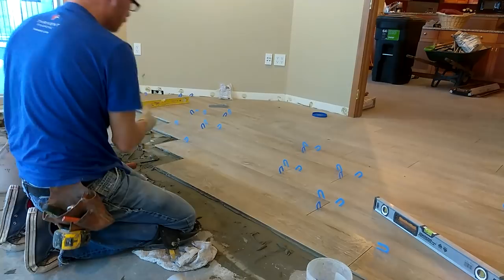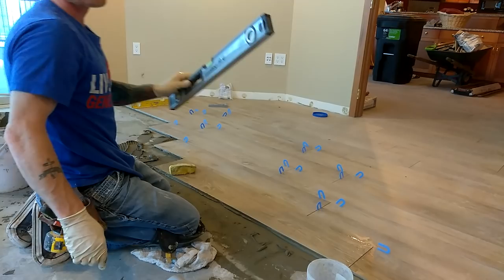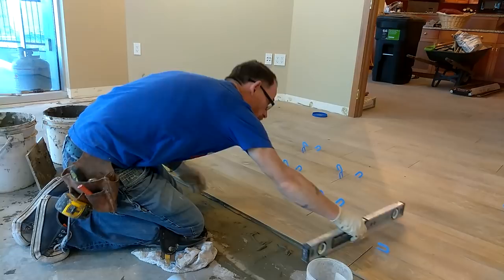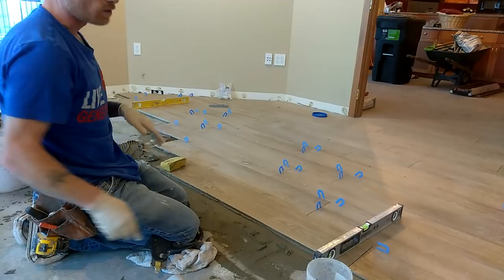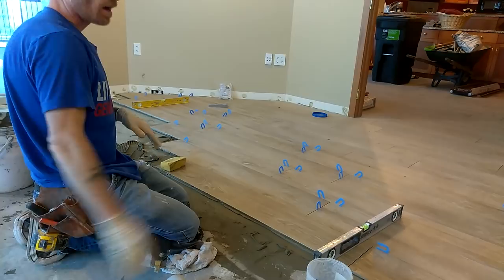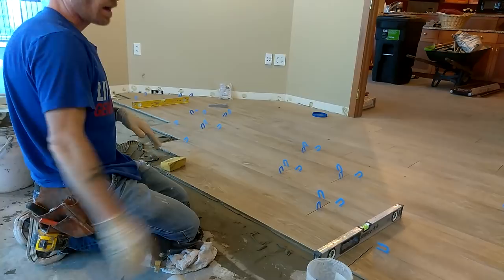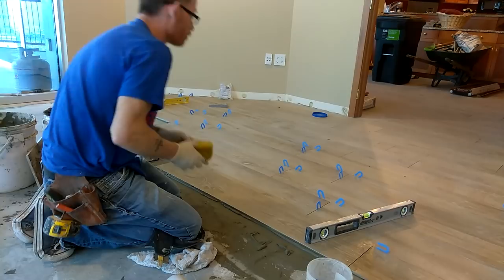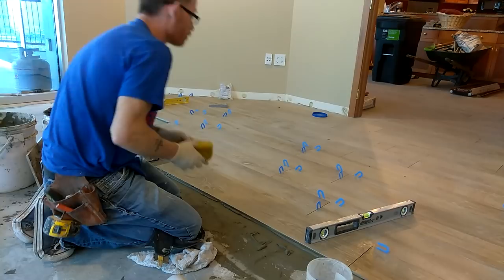Now I've got no lift here — that's what you're looking for. I usually use a two-foot or four-foot level, sometimes a six-foot level depending on the floor. Lay that on top and make sure you're flat. If you're riding high on one side, manipulate the tile with the thinset under there and get it perfectly flat. Especially when you use bigger baseboards, you want your floor to be flat — otherwise you'll see a big gap underneath your baseboard. We use a level all the way across the floor to make sure it's completely level both ways. We work on a lot of high-end jobs, so level is always key with doors and base. It makes everything easier and your floor looks a lot better when finished.